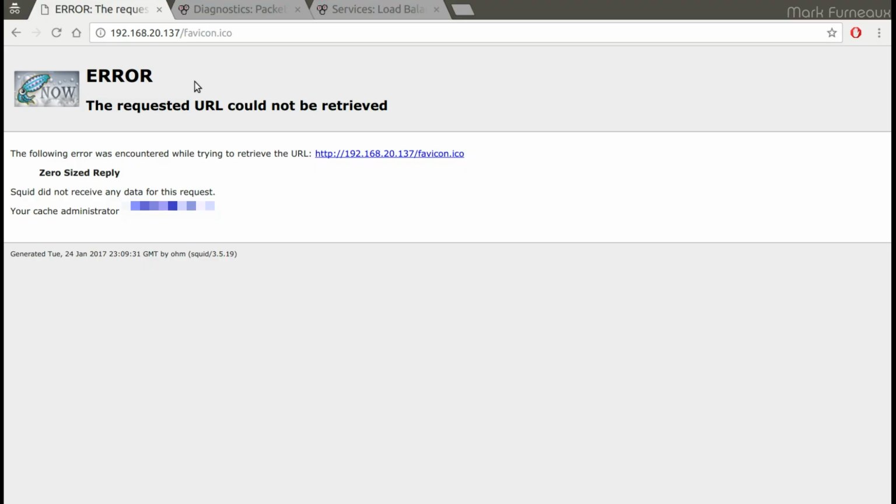So I'm sure that there is a page that you can access somewhere. I don't feel like they would take it out, but the search space of all possible URLs is just far too large to brute force at 4 pages per second, which is the speed I was getting. So realistically speaking, it's just not possible for us to figure out what it is, because it's probably something custom. And it's not a real web server. It's just basically doing a direct string match between the URL and some internal value in the flash ROM. And so if they don't match exactly, it doesn't return anything.